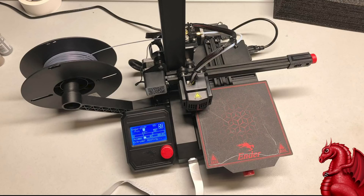First, with the smaller bed you have less mass on the Y axis — that means less inertia to overcome when printing, so when you're doing direction changes on the motor you'll see less of an issue with ringing than you would on a larger aluminum or glass bed. Second, they have a redesigned fan cooling duct for parts cooling. On my other Creality printers it's aimed more toward the base of the nozzle; on this one it's aimed right down at the nozzle tip, so you're getting better cooling on the filament as it comes out.